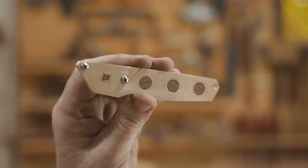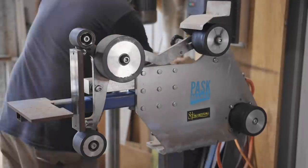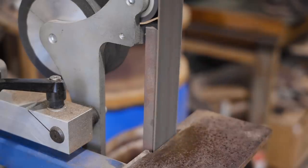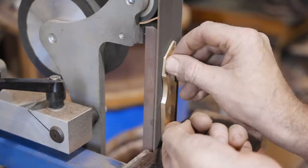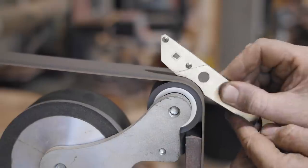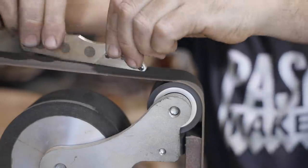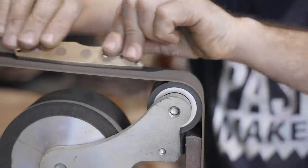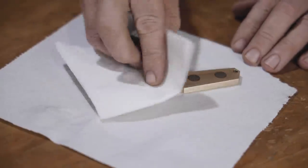That's starting to look pretty good. I've sanded it to 400 grit. Now I'm going to put a cork belt on the grinder and polish it up and ease the edges over. The polishing belt is 400 grit — I do have an 800 but I don't reckon it's worth going that high as it's going to get scratched and dinged with use anyway. I reckon it'll look better when it's got a few scars and that used look.